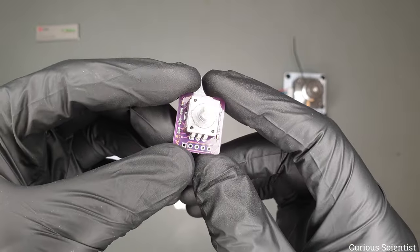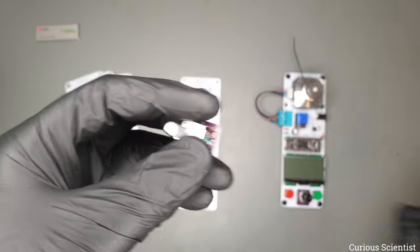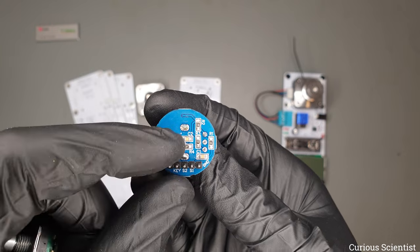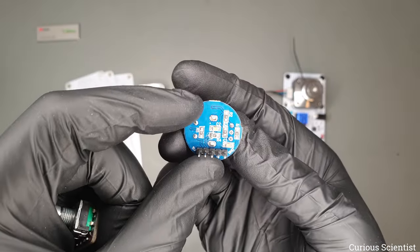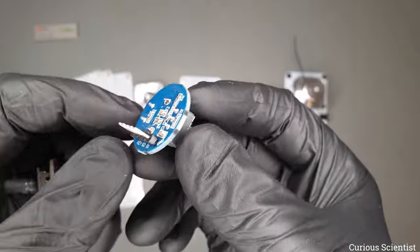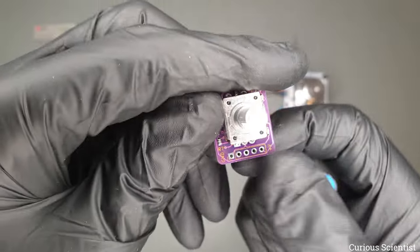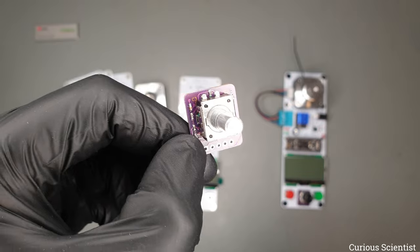It was a question a few times under my videos or in private messages. So actually you can buy this module from AliExpress, which is almost the same module. It is kind of debounced with these RC filters, but it doesn't have a Schmitt trigger circuit, which I have. But it has the same pin layout, so you can use this instead of using my design. So you don't need to purchase this if you don't want to. This is just some fancy thing.